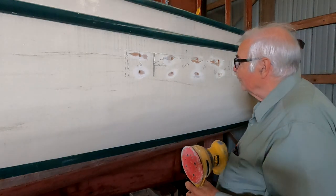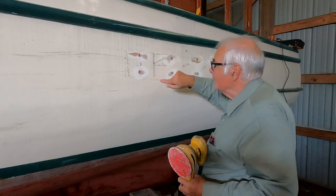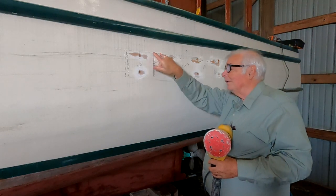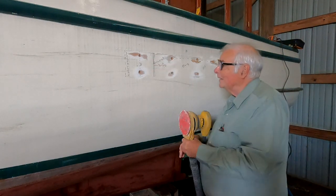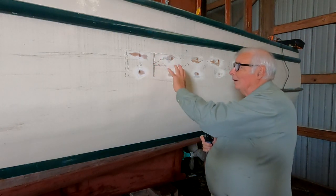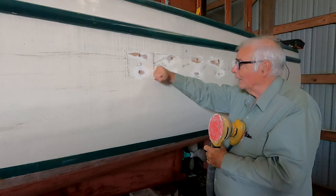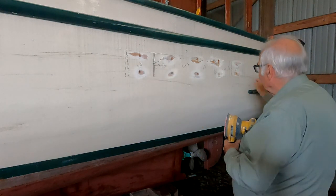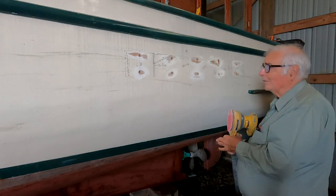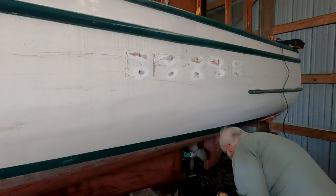The first thing I'm going to do — this is a plank edge here. When I look at this at an angle, because it's a little more light today, I can see there are fasteners here that I need to expose that I missed. The fact that there are fasteners here says there's a butt block in here. One of the advantages of what I'm going to do is I'm going to get rid of this butt block and join this plank to the plank back here and make it all one plank. The first step today will be to sand off the paint and make sure I know where those fasteners are so I can get them out.